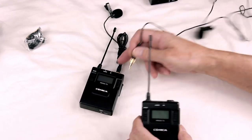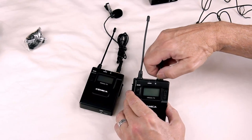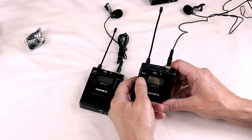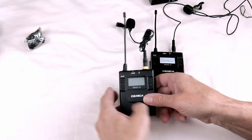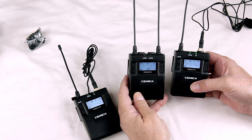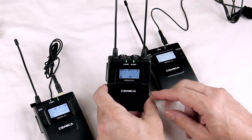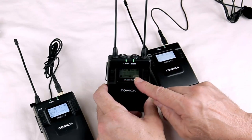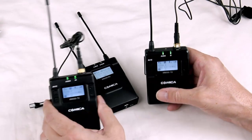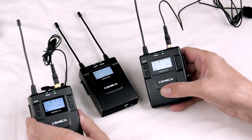So let's plug in the microphones. This one's already in. Let's plug this one in. Just turn them on — there's the on and off button. Now we're going to want to scan for the best channel possible that has the least amount of interference. If you look on our receiver, it says Group A Channel 33, Group B is at Channel 57. If you look at Group A and Group B, Group B is Channel 66, Group A is Channel 41. So they're not even close as far as channels.